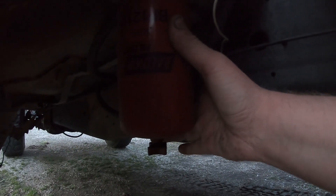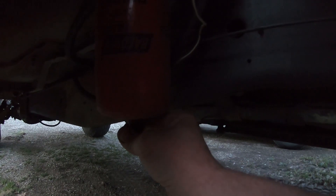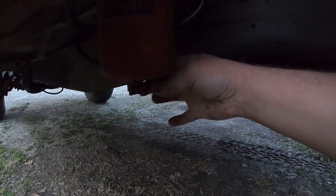It's actually been about two, maybe three years since I've changed the primary filter for the oil tank back here, so I'm going to go ahead and do that now that I'm thinking about it. I'm going to spin that off real quick and show you how simple this setup really is. Shut the ball valve off — this is a Wix filter head with a Baldwin BF 1212 filter, which has a two-micron nominal rating and about a 15 or 20 absolute — plenty for what we're doing. I'm going to crack this drain and let this filter drain out completely.